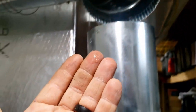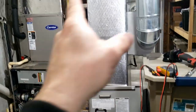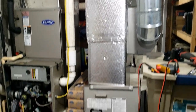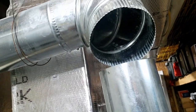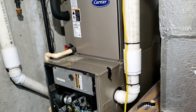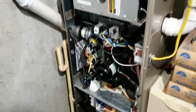We do have atomized mist up here. I think what happened was, since it's a recirculative humidifier - it just goes down, up, down, up - it was running so much that the humidity was so high it was just condensating. You have high humidity coming in, going out. It's the only logical thing. It surely isn't from a water line dripping - nothing up there is wet, we have nothing in the evaporator box. It's 48% now and it was 50 when I got here.